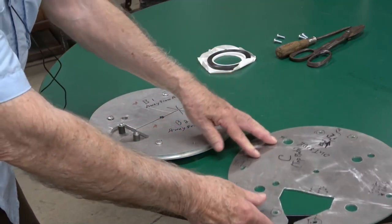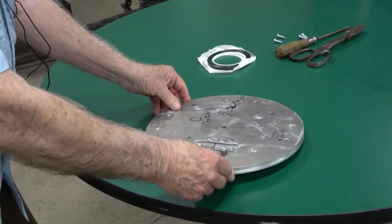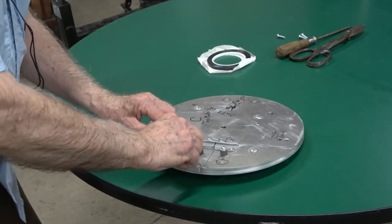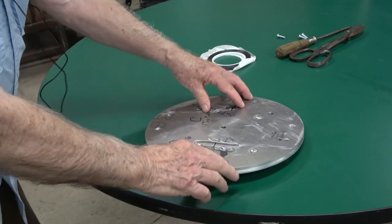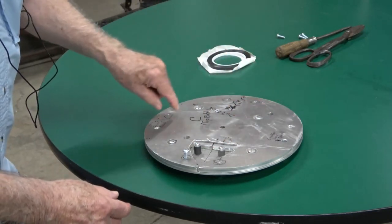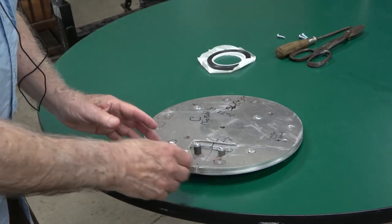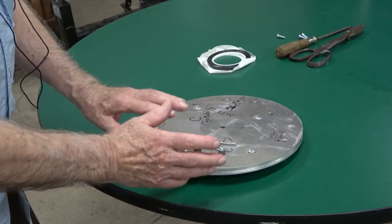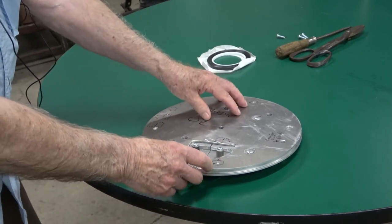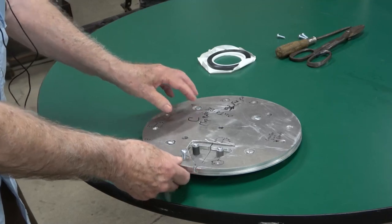And then we take the cover plate, and that goes on essentially like that. And then you screw it fast with the screws in the mounting holes here, like so. When that's together, you have a completed mandrel ready to begin putting the tape on, sticky side out, so that the tape is on the outside, because when we wind the wires on top of the tape, we want them to nestle into the sticky stuff to hold them in place. Once you fasten this together at the right dimensions, the next process is to put the tape on.